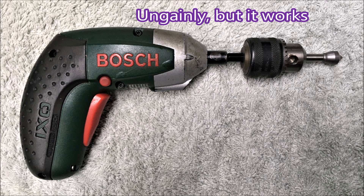I've been asked a few times how I deburr parts when I take them off the lathe, and this is quite often the contraption I use: that's a cross-hole countersink in a small chuck in a Bosch screwdriver. I'd like to get a cross-hole with a hex on it so I don't have to use the chuck.